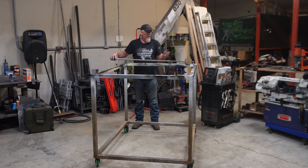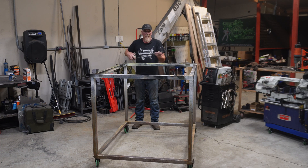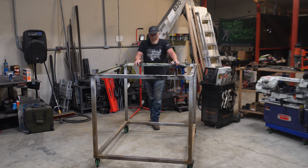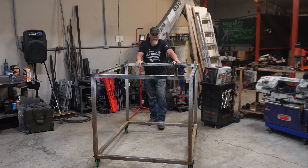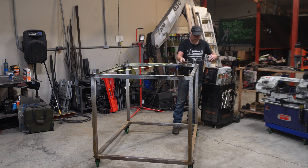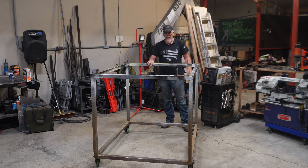The wide frame width is 42 inches, so you just take a second piece of angle iron and weld it on at 42 inches. Do that on both ends of your cart. It's very important to make sure this is square when you build it. Verify that it's square by measuring diagonally from one corner to the opposite corner, then do the same in the other diagonal direction — these measurements should be identical. If they are identical, you're perfectly square; if not, adjust before you fully weld the cart together.